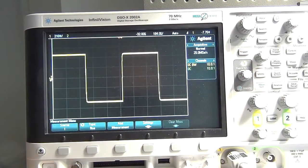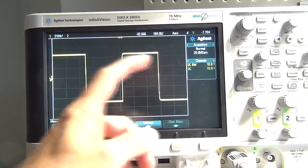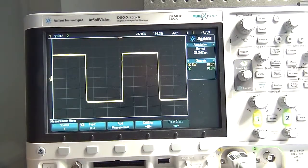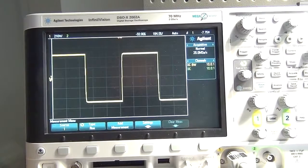And that's where you want to dial in that resistance so that you slow the rate at which the capacitor is charging to get a nice curve so that you can do the calculation. So that's the beauty of this box. I can dial in 0.1 ohm, 1 ohm. I'll start dialing in literally. I'm dialing up to 9 ohms, you can't see much. If I start going on the 10 ohm scale, so I've got 10, 20, 30, 40, 50.